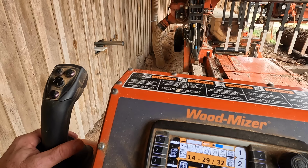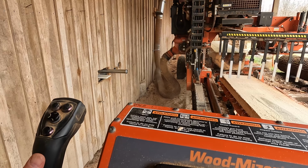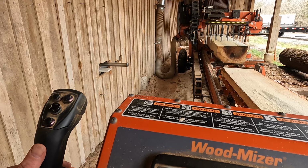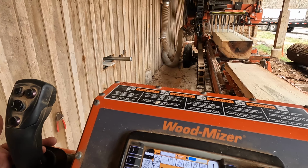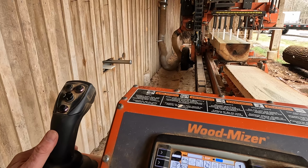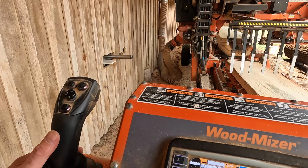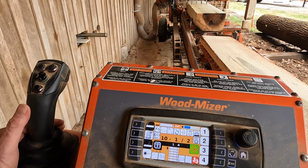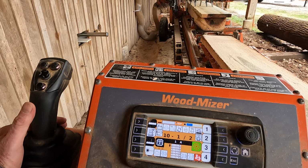I can see a whole side opening up. I know that if I have wind shake on this right-hand side, I'll be able to take that off by vertical grain sawing. That's another technique I have demonstrated. So I'm going to pull these guys off. Now you'll notice the cool thing about these drag-back shoes is I can also stack wood on top.